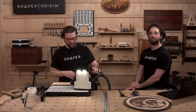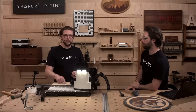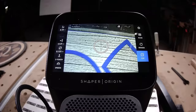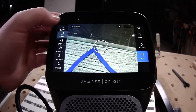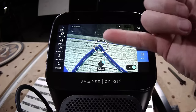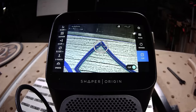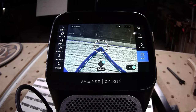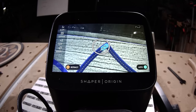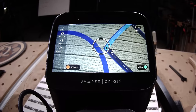Nice. We touched on this in the past, but that little selective cut that I was doing just on the ends of those pieces. Yeah, I was about to mention that, but then you went through them so quickly. So I'll just do an air cut. In order to make it snap right to that corner, right to that 90 degree turnaround, I'm biasing my corrective range on the outside so that when I plunge, it snaps to that corner. And same thing for this. Yep, it's going to snap and stay stuck to the closest point.